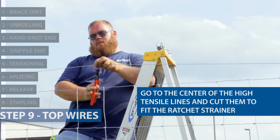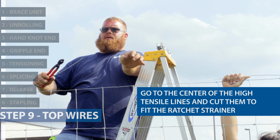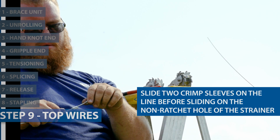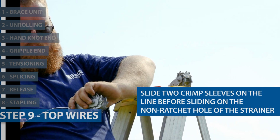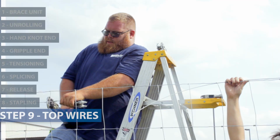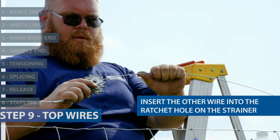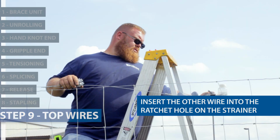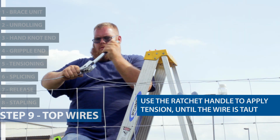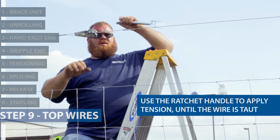Lastly, go to the center of the high-tensile strands and cut the wire to install the ratchet strainers, which will tension the lines. On one end, slide 2 crimp sleeves, then slide the wire through the hole in the strainer and crimp them. Insert the other end of the wire into the hole inside the strainer and use the ratchet handle tool to apply tension. Once the wire looks taut and feels tight, there is enough tension.